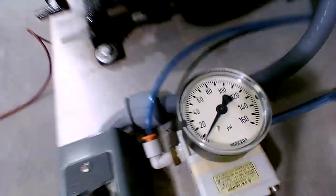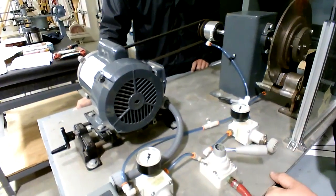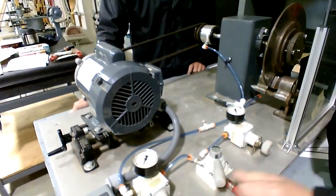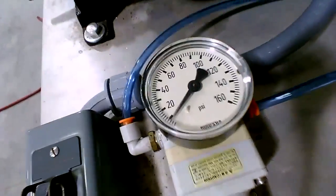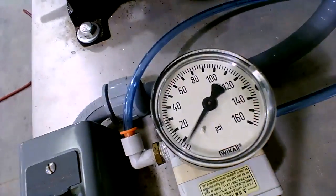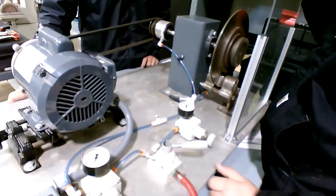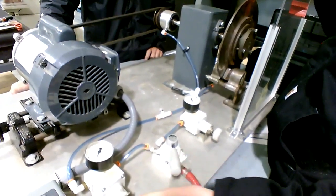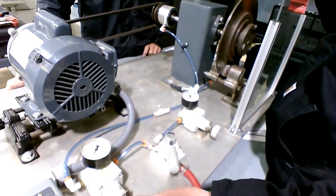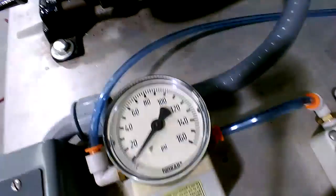And just like a lot of things in maintenance, you've got to fine tune things. So now shoot on over to your brake. Nice. Now go back to do your clutch. That's still a little bit weak, isn't it? Okay, so he brought it up a little bit closer to about 8 pounds. Now shoot on over there to your brake. Good. Now hit the clutch. That's quite a bit of a delay there. I'd say kind of increase a little bit.